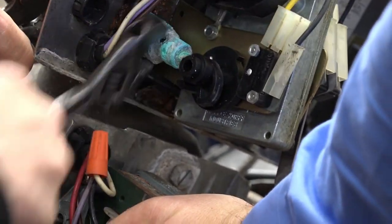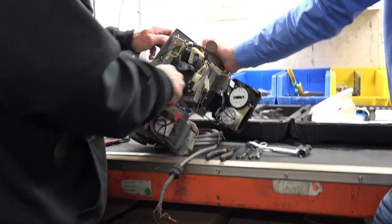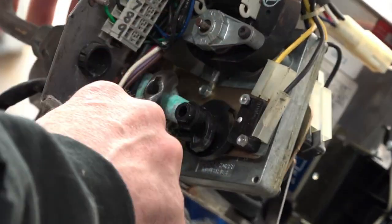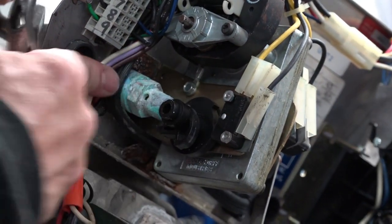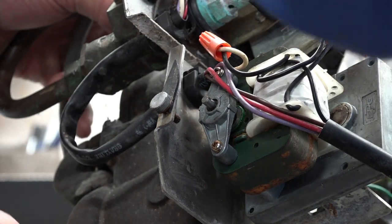So as you can see, those can get very crusty. You can also see this is stuck. The brine valve is stuck. So the brine tank was overflowing nonstop. It actually looks like it's loosening up, but the brine valve is actually so stuck, it's not wanting to come through. Yeah, it's turning. It's supposed to turn out of this. So what's happening is it's stuck right here.